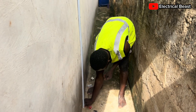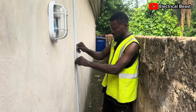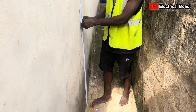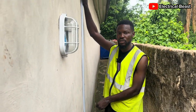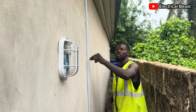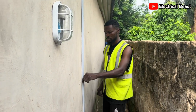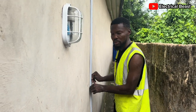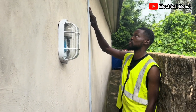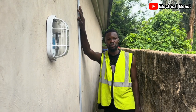So these are the results. Just look for a way to take the wire down to the earth rod, twist it around the earth rod and ensure that it's tightly connected. Then look for something like a trunking pipe or a conduit pipe to place the wires inside. Put it on the wall so that the wires will not be visible, because the protective system is not supposed to be exposed to harsh weather conditions.